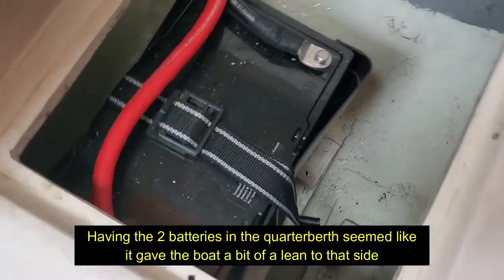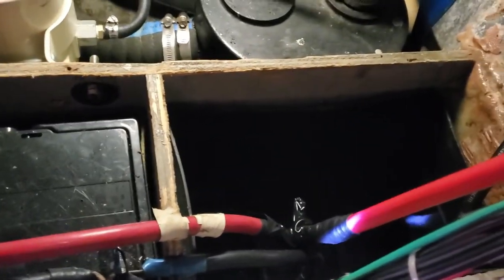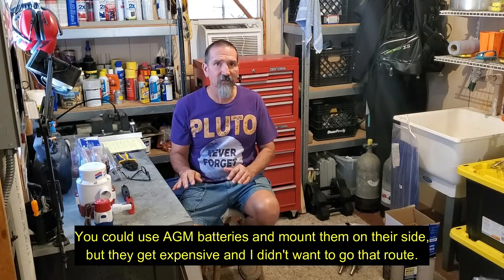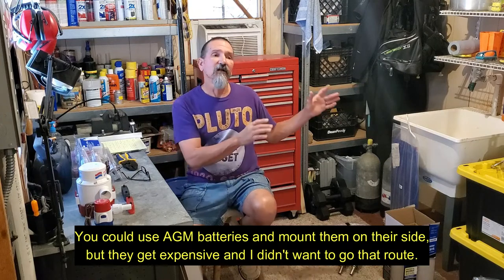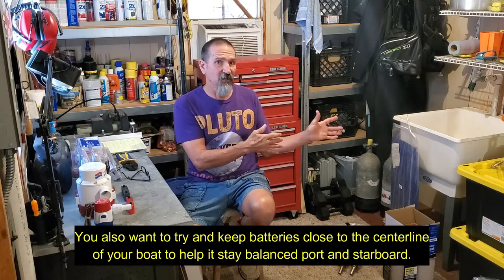I don't know how much sailing we're going to get over the next month — we've got a camping trip coming up next weekend — but it is what it is; sometimes you've got to focus on the projects. The other project is the battery situation. My boat essentially had four separate batteries in two separate compartments, which I've never liked. Two of the batteries were bad when we got it. What I've found is I don't have a lot of room to mount batteries — they won't fit in my bilge, which is too shallow. The factory boxes are for two Group 24 batteries.